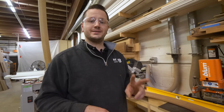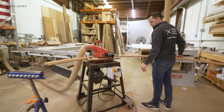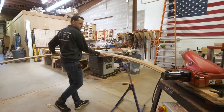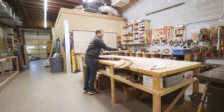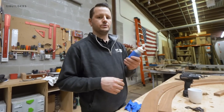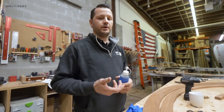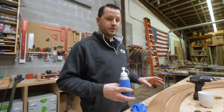We're going to go ahead and make a second pass, which should be our final cut on our first layer. Now that we have the first layer cut, we can go ahead and glue up the second layer. We're using a polyurethane glue just for its extra weatherability. These are really great glues for outdoors, and I have had some waterproof and weather-resistant glues fail on me in the past, but I have yet to have a polyurethane glue fail when doing anything like this.